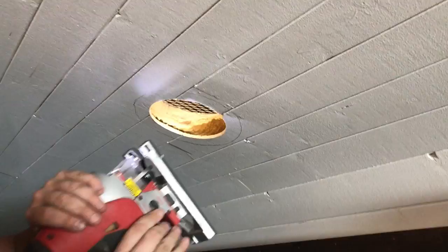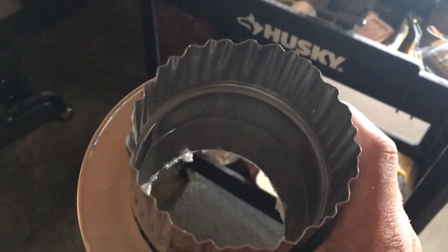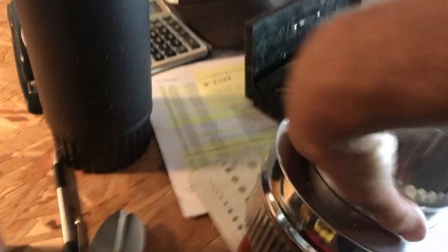We got the hole through, so we're just cutting back the wood material from the insulated pipe. The double adapter reduces down from insulated down to single wall. The stock crimp on it doesn't really fit very well in the single wall, so it needs to be just persuaded a little bit — crimped just a little bit further — and then it's a very nice snug fit. Yeah, that just needs to be crimped down a little bit more to fit in there.